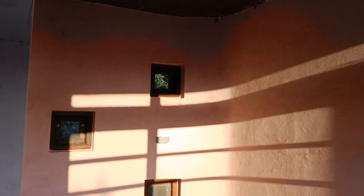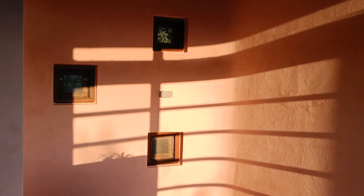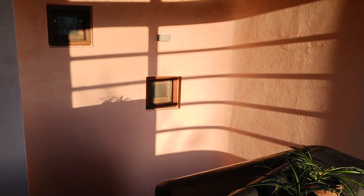If you think back to houses of Goa or Portuguese villages, which are this classically lime washed imagery — that works because of the way the lime particle refracts light. And that's what makes everything to do with lime special. The minute you add 5% polymers or 1% plastics, that entire visual aesthetic is overridden by these other things, and you lose that very unique and specific aesthetic.